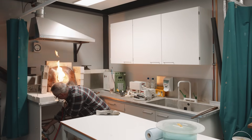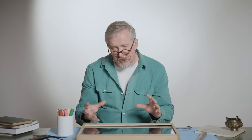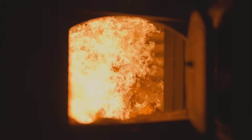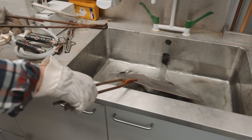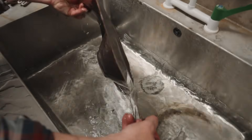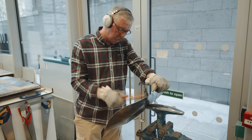This gas torch is using natural gas and air to heat the bronze sheet. The original makers probably worked this metal on a furnace of hot coals with bellows to reach the temperature needed to anneal the metal. You heat it up to about a cherry red colour, which is then instantly quenched. That whole process is called annealing, which softens the structure of the metal and relaxes it after it has become very work-hardened. You can then apply the metal to the stake and with the raising hammer do a further round of raising.